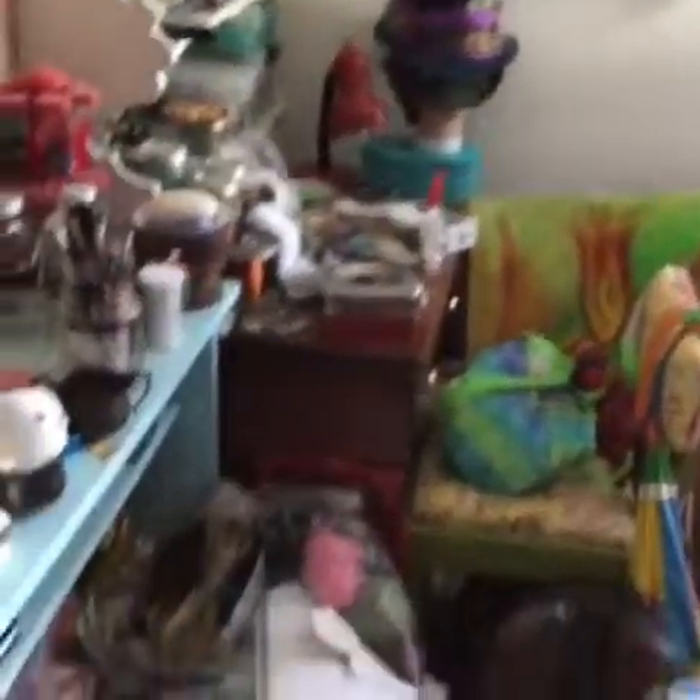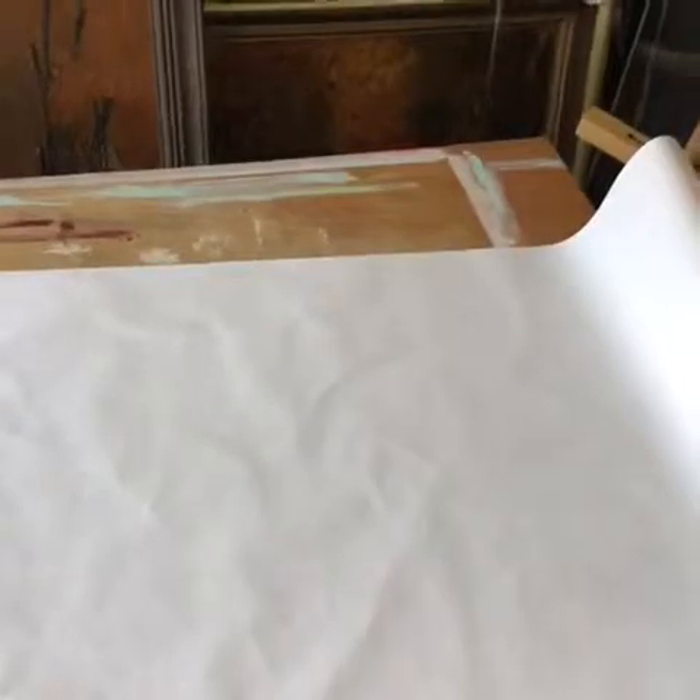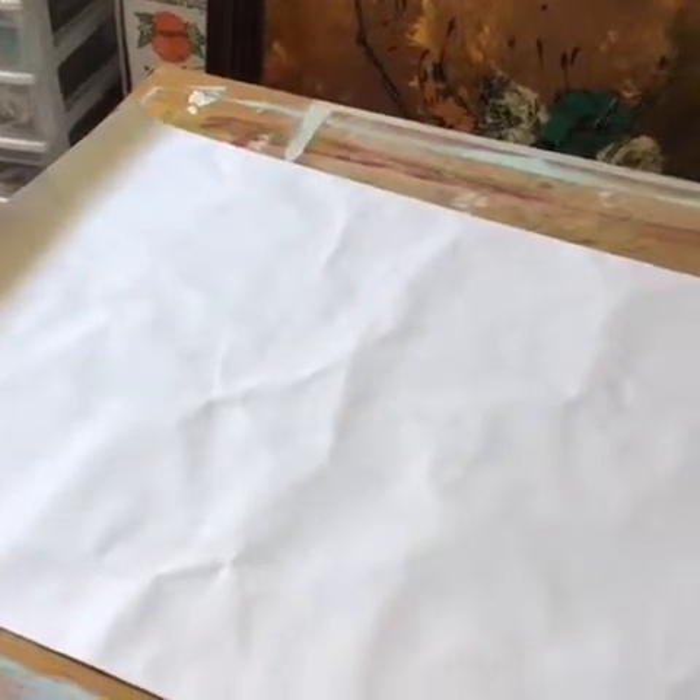This is my tiny little studio, and it's in the process of being reconstructed. I just tore apart this corner and washed all the walls. Here's the wallpaper on my table — this is where I'm going to paste it, and then it drapes down over the end. I cut three lengths of 8.1 feet because my wall is just under eight feet, so you cut an inch on each side for wiggle room. I didn't check the pattern match, so we may be redoing this.